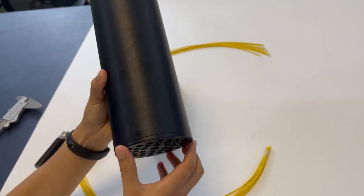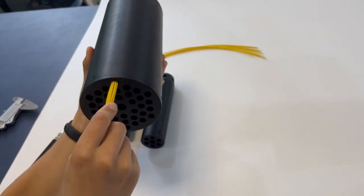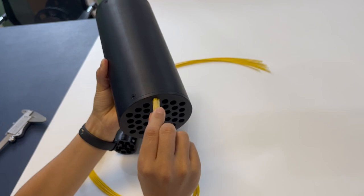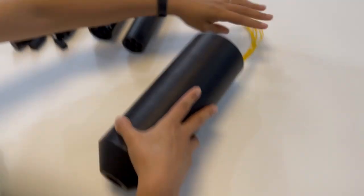It has screws here to remove the cap, and it uses glue to fasten the tubes inside and fasten the tubes at the output end. Then you place the main cable inside and perform the furcation of the cable. This is the finished product of the fan-out kit in use.